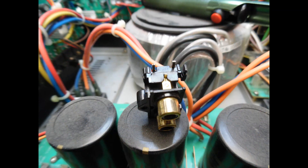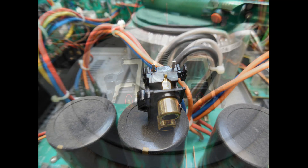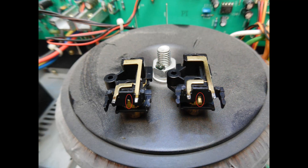In this photograph I've highlighted the snapped-off ground pin on the board. These are not low quality RCA sockets — they are gold-plated — but very strange. The same issue affected even the single center RCA socket, so all of them needed to be replaced. Rather than soldering link wire around the broken connections, brand new RCA input sockets were installed throughout. That fixed the issue associated with the power hum we were hearing — you'll see the new sockets later in the tutorial.